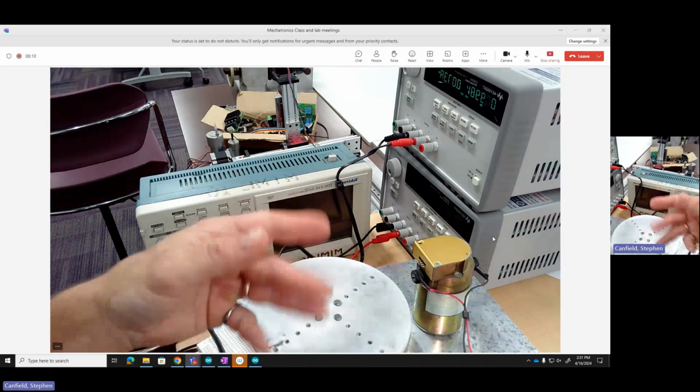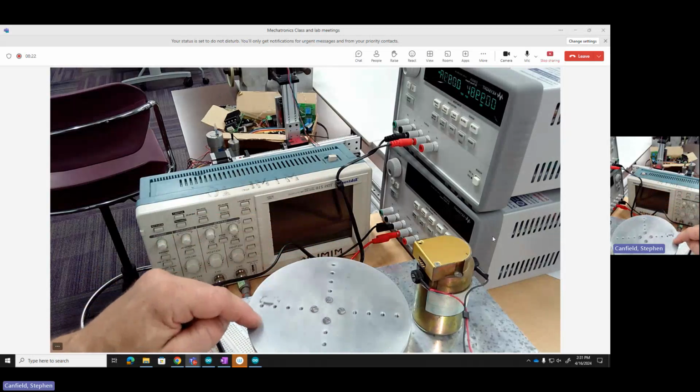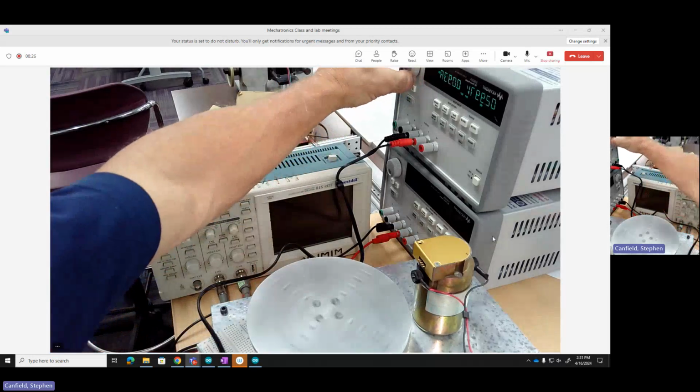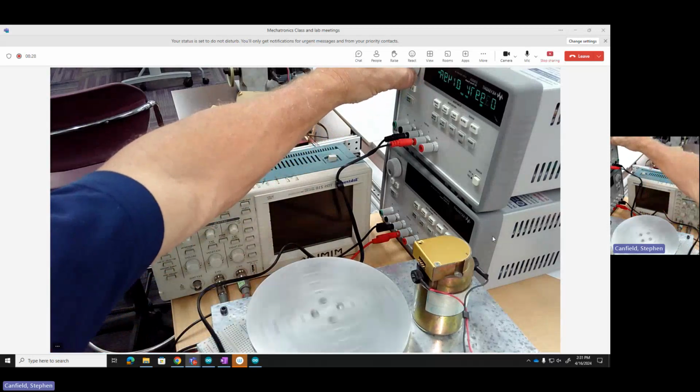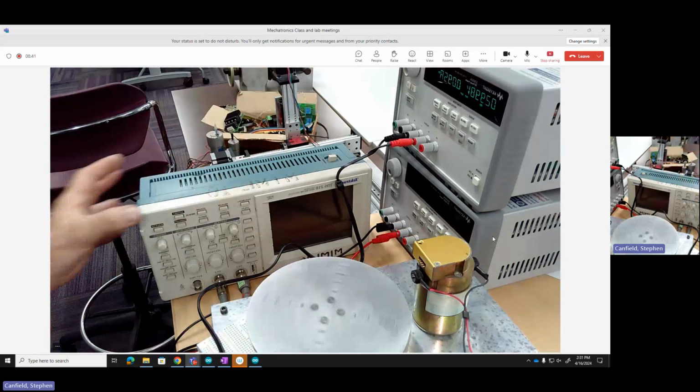Oh, there was about a 3-to-1 reduction off the motor. So the disc is traveling at about 1/3 the speed, but 3 times the torque. There's 3 volts, 4 volts, 5 volts. We know that speed should be generally proportional to the voltage. So I'm controlling the two there. Okay, so I'm going to leave it right at a middle speed. Next, let's connect our